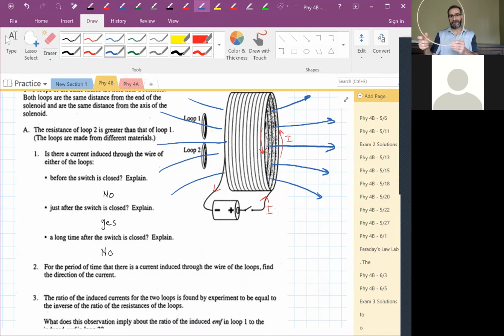That's called Lenz's law. And that's how we determine the direction of the current. The magnetic flux due to the current that's just starting here opposes the change that caused the current to flow to begin with. So if we have no flux here, and we turn on flux away from the camera toward me, then the current has to get set up to counteract that, to try to reduce it back to zero. So it would have to go in this direction or counterclockwise for you, right?